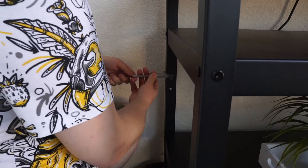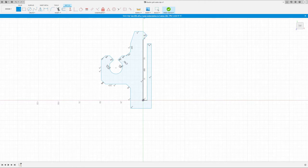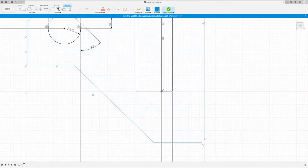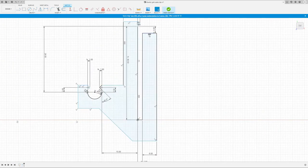I want to create clips for holding the device on the side of the table leg, so I took the necessary measurements and fired up Fusion 360 to design this cable clip. It is quite a simple part — it only has slots for the table leg and the cable. I'm going to put one clip on either end of the device. I simply create the clip profile with a sketch, use the extrude command to create the necessary height for the clip, and then add some fillets.